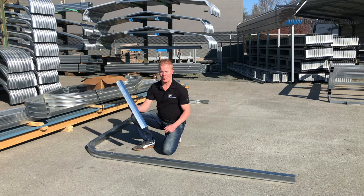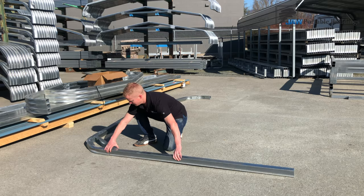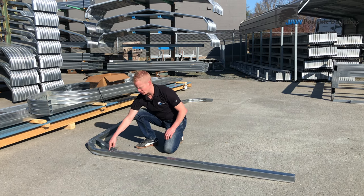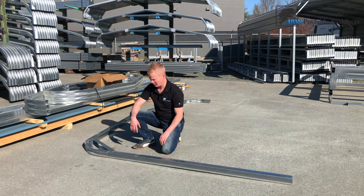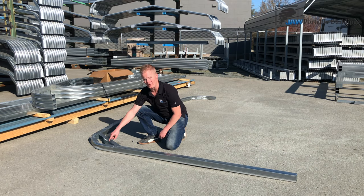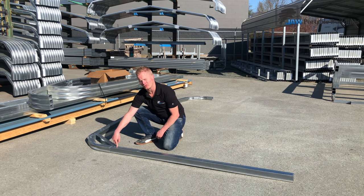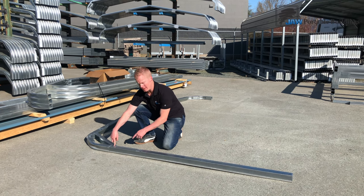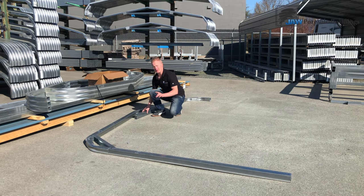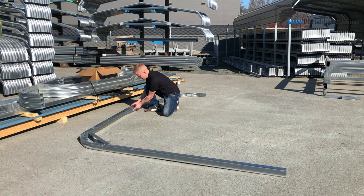These corner braces go into the corner. What we like to see is that the corner brace gets screwed into the leg, not into the rafter — this will help stop the wobble of the building. Whatever you do for screwing on one side, do the same on the opposite side of the rafter. You're going to have a screw into the rafter, into the dowel, into the dowel that goes into the post, as well as into the brace in the corner. On smaller buildings that don't have a welded center collar tie, you're going to put a brace dead center of the rafter as well.